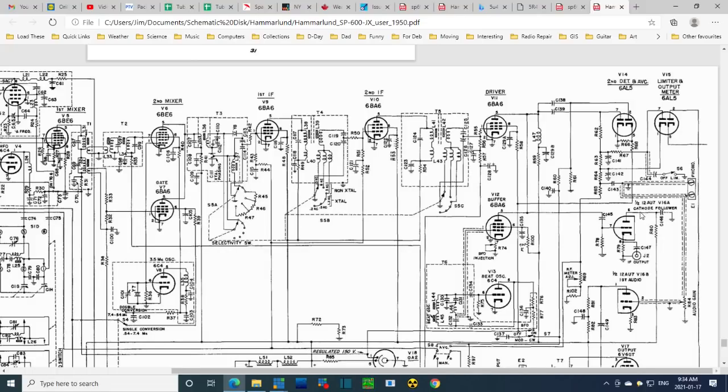It has to be right on the terminal here, because that's where the capacitor is. The purpose of this really is to drive this IF output, and I'm even thinking of popping this tube out, but I guess I can't because it drives the audio. But at the same time, I'm thinking about taking all the audio tubes out of this radio, drawing the audio off earlier, to cut down the number of tubes running in the radio and cut down the load on the power supply, literally. Well, there's no reason why I need all these tubes in the audio section.